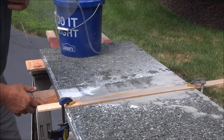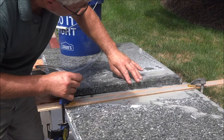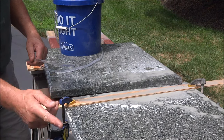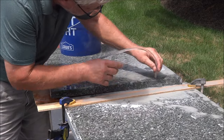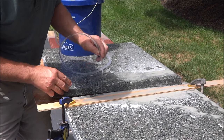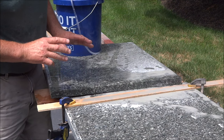Let's see how we did here — put a little water on that to clean it off. I think we did pretty darn good. We made a very nice cut there. I had a couple of pieces underneath both sides all the way along so it gave me a little extra space and it didn't flop down when I cut through it. I'm pretty darn pleased with that. Now I've got one more cut, and I've got to figure out exactly where that's going to be so I don't mess it up, because I've only got one piece of granite.